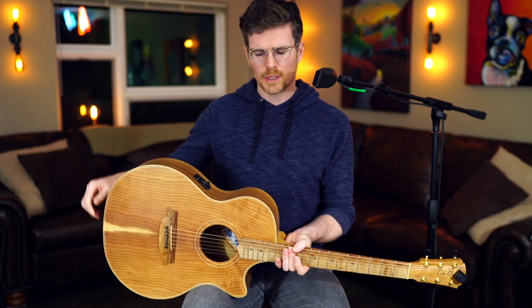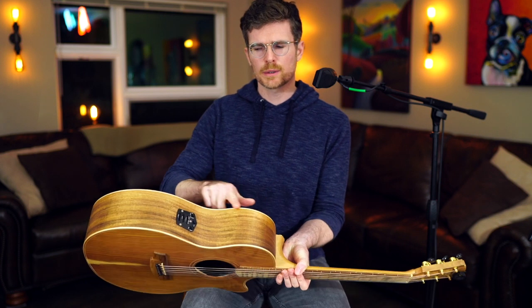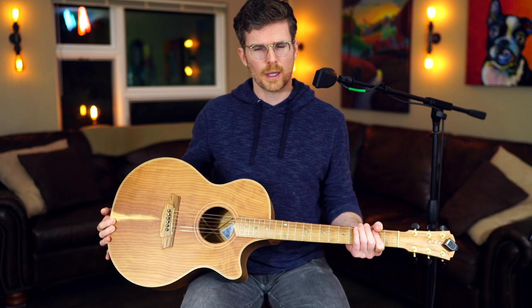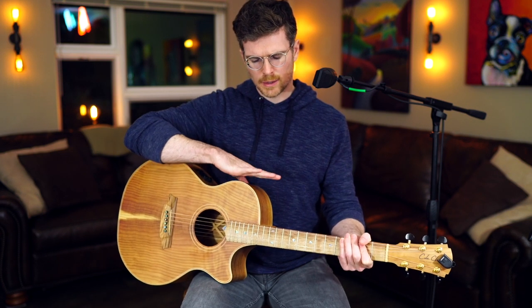traditionally built wood guitars have all these 90 degree angles from the front to the side and the side to the back, which create all these sharp ridges. And so when you're holding it, your forearm is sitting on a ridge, and some guitars have a bevel there to soften that. But the bottom, this smooth surface, isn't what contacts your leg, because nobody plays a guitar like this. You tip it back and turn it, and then the weight of both your arms pushes that sharp ridge into your leg. This sharp ridge back here gets pulled into your ribs, again with the weight of your arms.